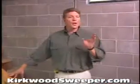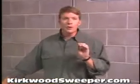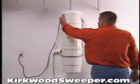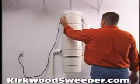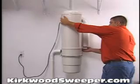All that's left to do is check the quality of your installation. First, check to see if you have a closed system. With no hose or handle attached and all inlet valves closed, there should be little or no air coming through the exhaust on the power unit.